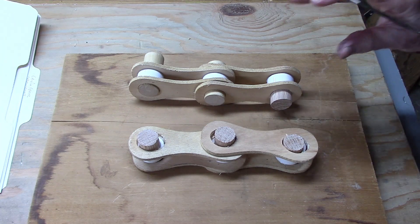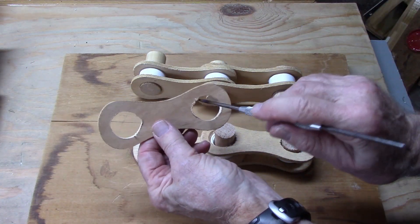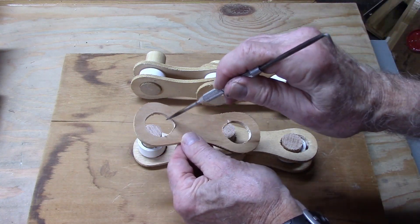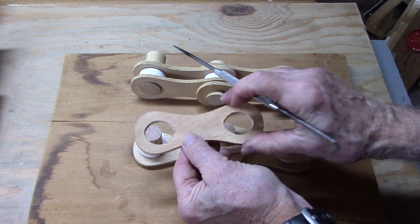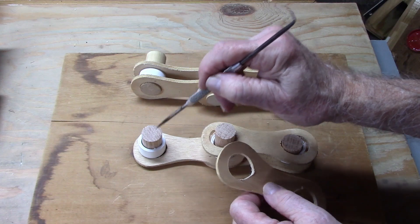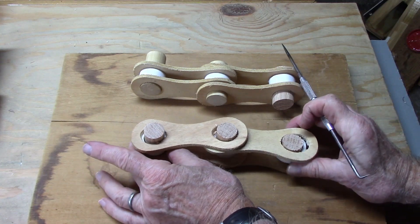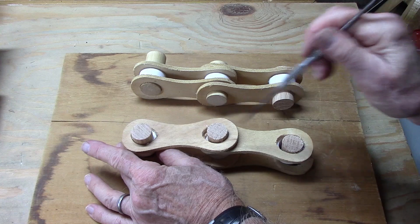Provided there's no wear, that's a new chain. With chain wear, the nice, round, circular part of the links — both inner and outer — become somewhat oval and deformed with the wear, with the pins rubbing on the link. There's wear occurring on the pins themselves as well as the roller, such that we can see it doesn't really stretch, but now can elongate as a result of this wear.